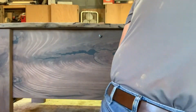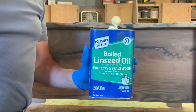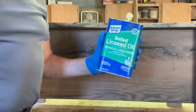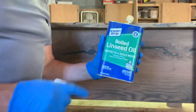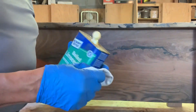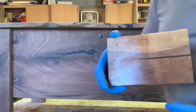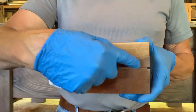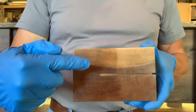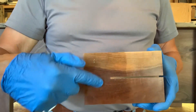Let me show you what I'm going to do. I'm going to use oil. You could use tung oil or other kinds of oil, but if you're going to use linseed oil, which is good and works great, use the boiled. If you don't use boiled, it doesn't dry, and then you've got a greasy mess. I did a sample — can you see the difference from this side to this side? This side had oil on it and this side I just put a clear finish on. I'm electing to go with the oil. It looks a little richer, a little nicer.